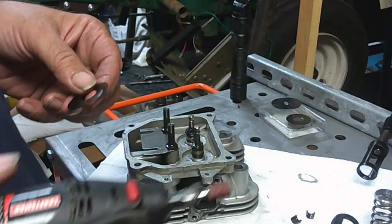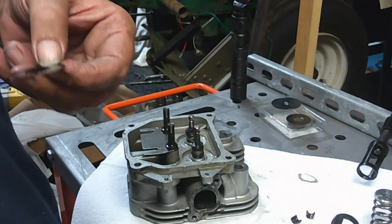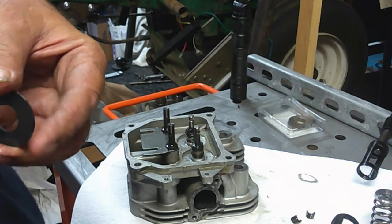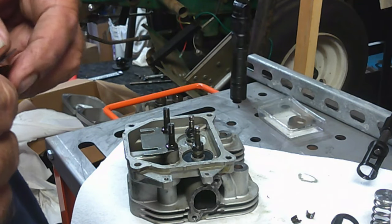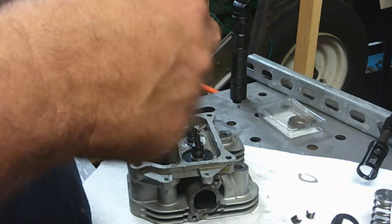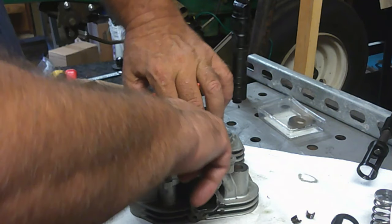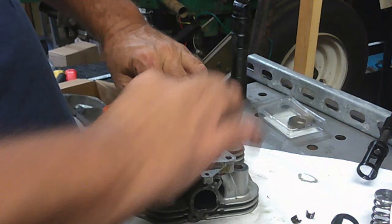What I've decided to do is take my Dremel tool, get in here, and just clean a little bit out. I'm going to do it outside so I don't get any metal shavings in here. I'll do all four of them. Hopefully that'll take care of the problem. I just held the Dremel on it for about ten seconds going around, and they fit right down in now — perfect. That's how I wanted them to. Got two on that one — that's 30 thousandths. Those fit down in nice and perfect.